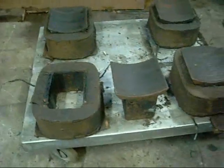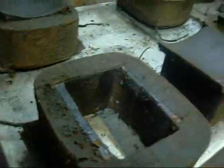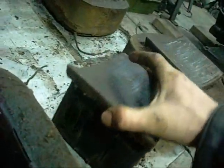These are the generator outer poles — the field poles. Obviously there's four of them: four iron laminated cores. Each one's actually got a number stamped on it, which is good. Those end pieces look like cast iron, not laminations. They've got four big rivets hammered through them. That one's got a three stamped on it, so that's number three.